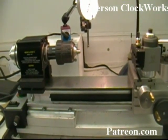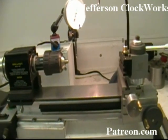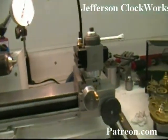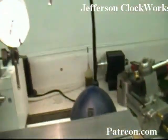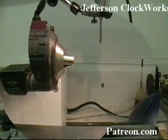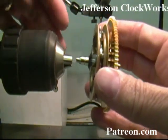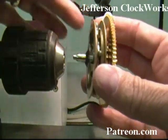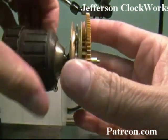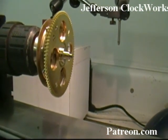I put an adapter on my headstock so I could just screw a Jacob's keyless chuck right on there. Having a keyless chuck is very nice — you don't want to deal with jimmy bars or a key because it takes too long, especially in a polishing process. The cross slide just comes right off since we don't need it for polishing, and we don't need any measurement tools — basically it's just a spinning chuck. I'll give you a bird's eye view and then remove the camera in case anything flings off.